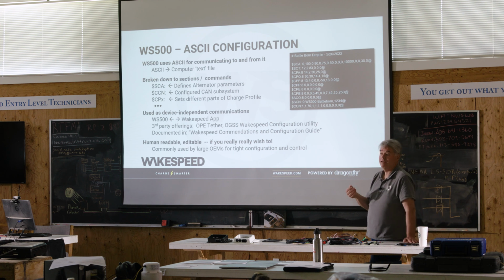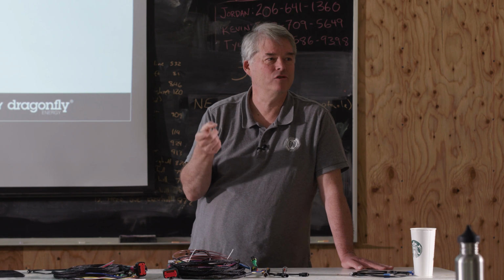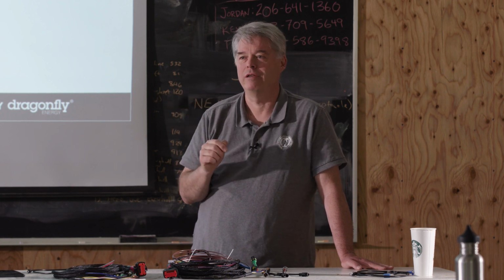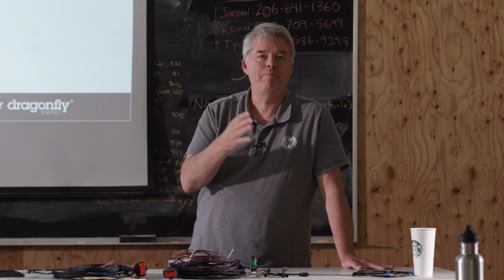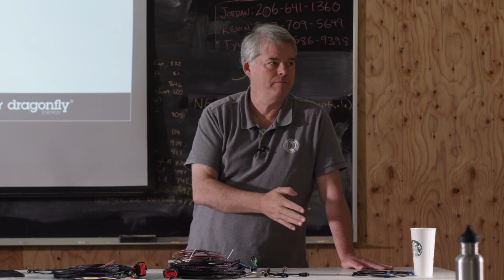We have lead acid batteries. The typical battery, believe it or not, the rule of thumb is 25% of capacity. That's from sailors. If you actually look at the batteries themselves, most of them are defined as a 10%, a 0.1 C rate. So every battery manufacturer and every battery chemistry has a different C rate.